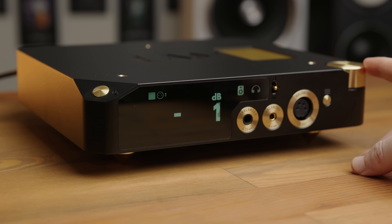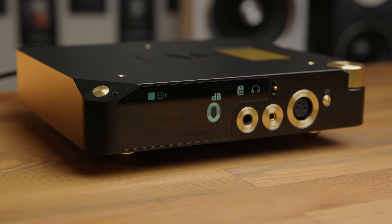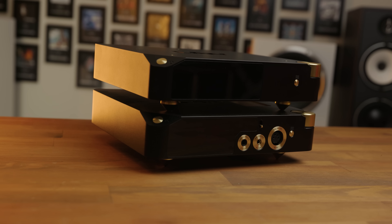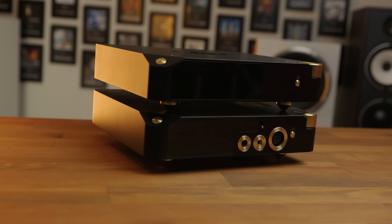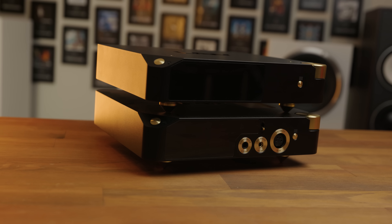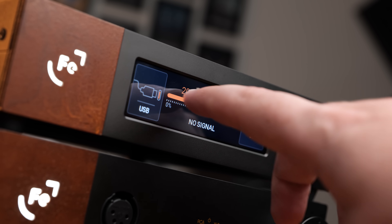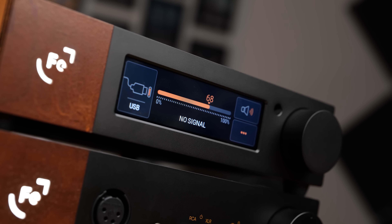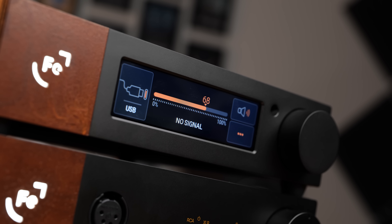Turning up the amp to maximum, the gain of the amplifier is 13.7 dB and it just has the one gain setting. This means with a normal 4-volt DAC feeding it, the max you'll get is 19 volts at the output — more than enough for basically everything. But if you are wanting to get up towards the 60 volts the amp is capable of — assuming you actually need it — then you will need a DAC with a higher output voltage. Options like the RME ADI-2 or the Ferrum Wanderer can both supply over 10 volts output, so with those you can get over 50 volts output at max. If you're looking for a source that'll allow you to get the full 60 volts this thing can crank out, well, stop and re-evaluate how loud you're listening, because otherwise soon enough you won't be able to hear anything.